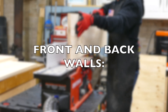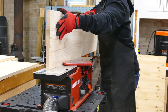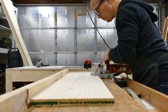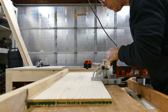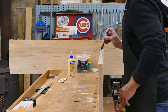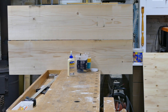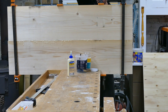For the front and back walls we used rough sawn 1x12s. We planed the edges of the 1x12s and joined them together using our world famous dry biscuits. We spread the glue with a brush to get total coverage and we make sure to get glue in the biscuit slots. After clamping we wipe off the excess glue making for a much neater job.